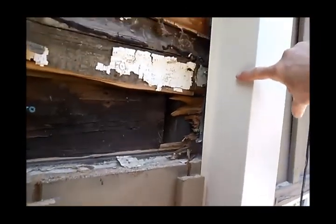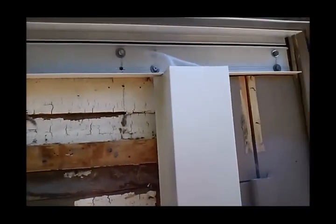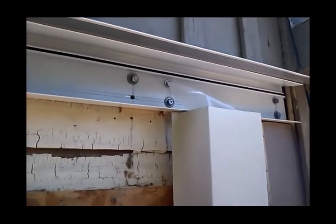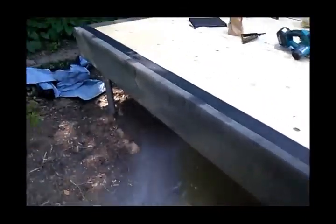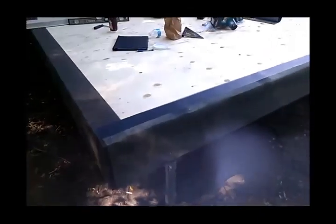The legs get progressively longer because of how badly sloped this house wall is. So we've got a beautiful cap to start our sunroom walls from, and you can see the poly sticking out the top that's protecting the aluminum from the pressure treated wood. The final job is the membrane wrap around the deck. The next step will be flashing.